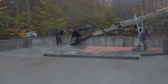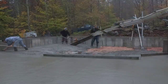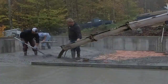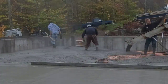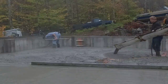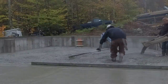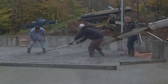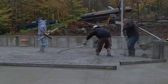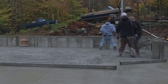I'm over there messing with that other trench drain, making sure the end of that load was sloped correctly. We're using warm water now — it's kind of chilly up here, we're in Maine, it's the end of October or first of November, mornings are in the 40s. What the batch man does is he turns on the boiler for guys pouring floors in the morning so he'll have about 100-degree water, and sometimes depending on temperatures for the day we'll even put some accelerator in to get it going. Once the concrete cools off after you lay it down — if it's 50 degrees out — it's still not going to set up that fast, but it does help give it a little kick in the morning.